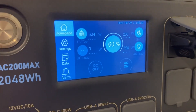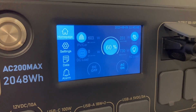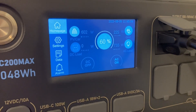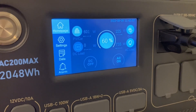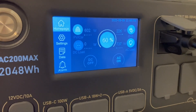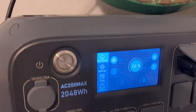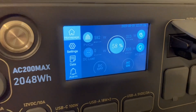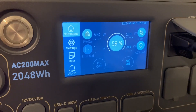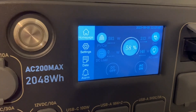We have 600 watts coming in now - the clouds broke and we're starting to get some sun again. 5 watts coming in and the air conditioner is pulling 735 watts, so we'll let it keep running. It's been over three hours now and we have 58% of the battery left. The air conditioner is pulling 940 watts. We have 598 watts coming in with the 800-watt solar array, and with the 300-watt array we have 213 watts coming in.